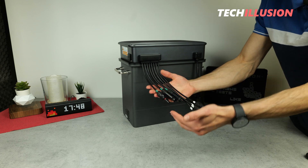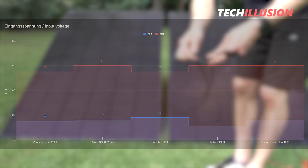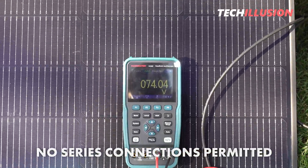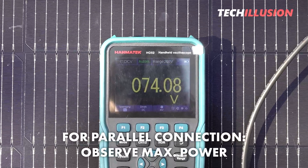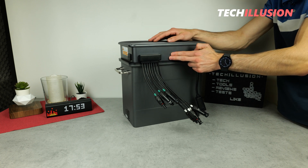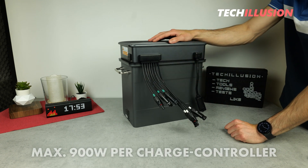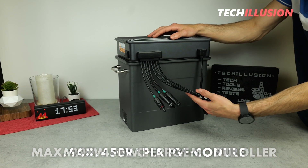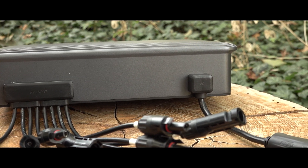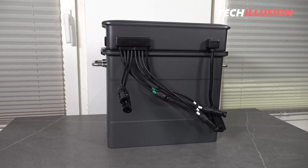The Hyper 2000 supports PV input voltages from 15 to 55 volts, allowing seamless connection of various solar panels. Series configurations must not exceed 55 volts, while parallel configurations are not an issue as long as the maximum power input is not exceeded. With a maximum input power of up to an impressive 1800 watts — 900 watts per charge controller and up to 450 watts per panel — you can easily connect four large 450-watt solar panels. This is particularly advantageous with high-capacity configurations using multiple stacked batteries, enabling fast charging and storing a significant amount of energy quickly.